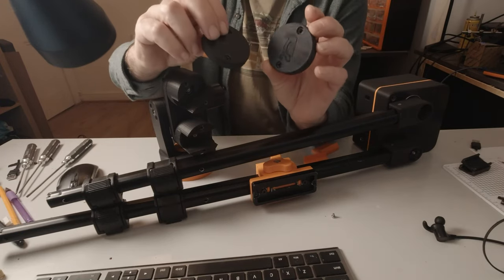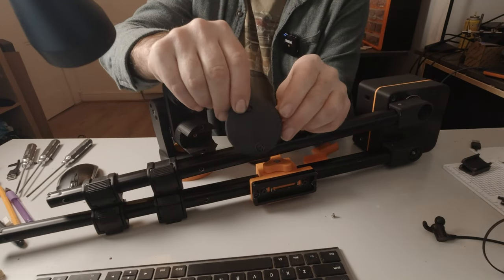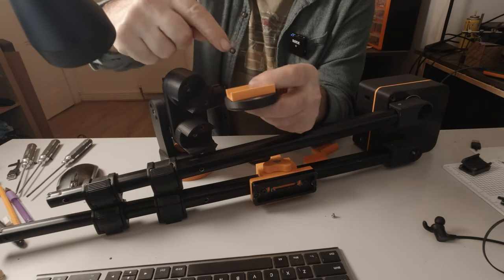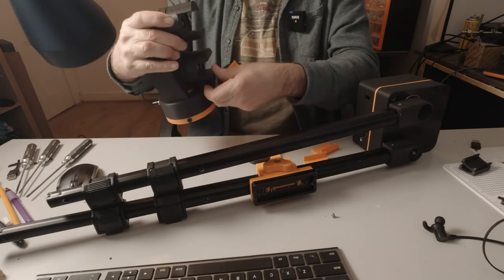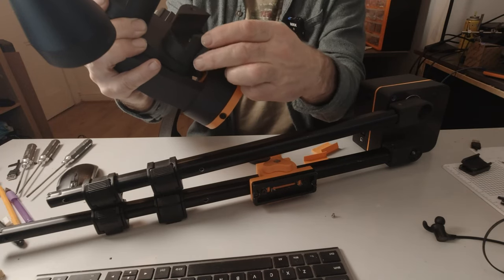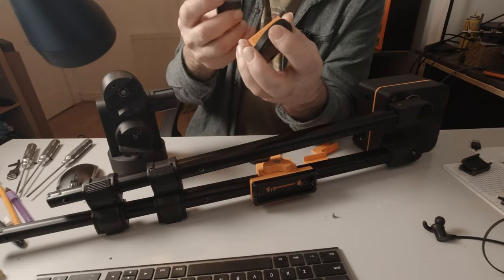Parts 28 and 29 are caps going on the front. The top cap has a bird on it — the bottom cap doesn't, but it has an extra spot on the edge for a 6x2mm magnet, which catches the end of the locking mechanism. It's important when placing the magnets that the two magnets attract rather than repel — a very important point, otherwise it'll do the opposite of intended.